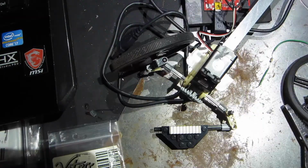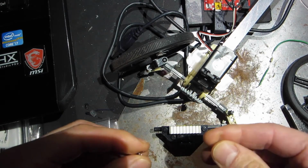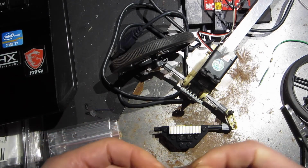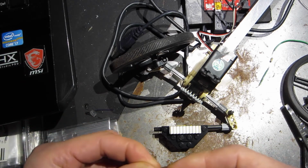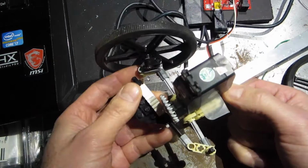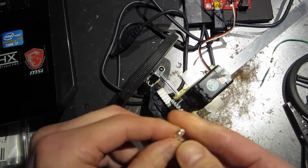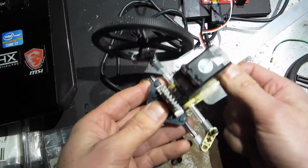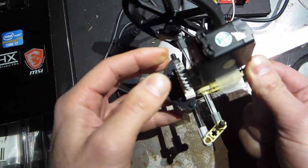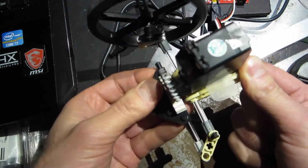I don't know about you, but this whole quarantine situation has got me thinking about things like 60 cycle hum fever. I feel like I got 60 cycle hum fever. As soon as I walk outside, it goes away. So anyways, yeah, the deeper down this little road I'm going, the more interesting challenges I'm coming up with to make up for the fact that this is a bad idea. Alignment issues. So if I build this, I'll have a servo that can self-align to an arbitrary center point, or to a top dead center, if you will, because this is a continuous servo and not a positional servo.